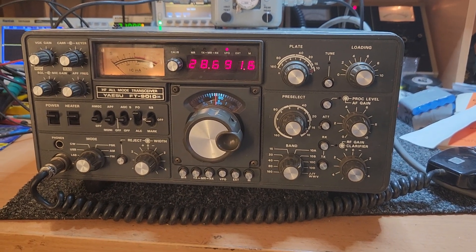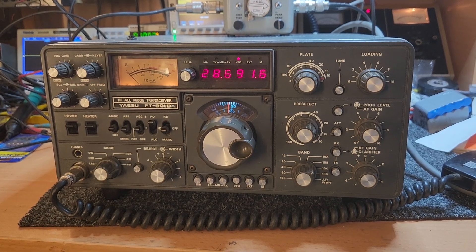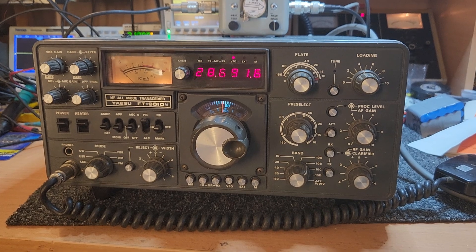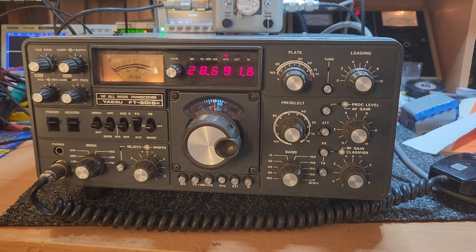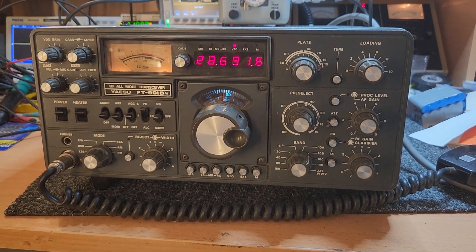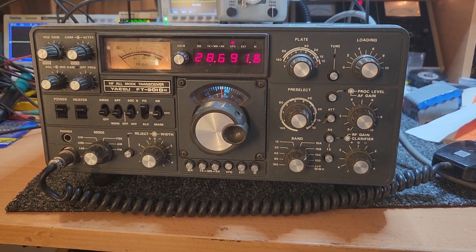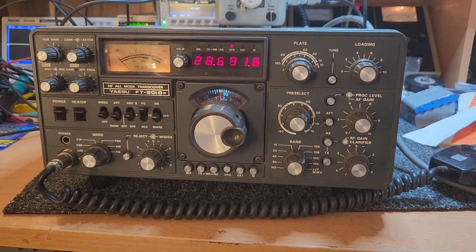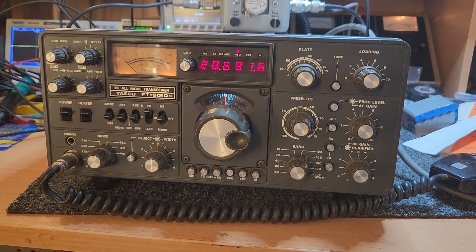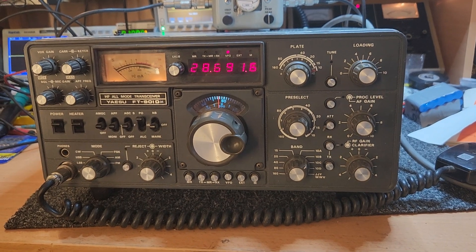The restorers haven't been saying 'I need this on CB' — most people are not interested in older gear like this being on CB. Most people want it to be a collectible that they've got on their shelf and pull out every now and again for a bit of a play. Because we can't get enough original crystals to replace them — people threw away the crystals when they changed over to 27 MHz, and even I didn't keep a stack of them. I really have to scrape around now to find one. We're certainly happy to change someone's radio back to standard every day of the week, but it's just a matter of whether we have the part. The 42.5 and 43 MHz crystal — that's a hard one to find these days without having to get it specifically cut.